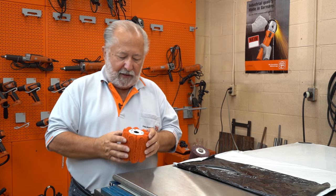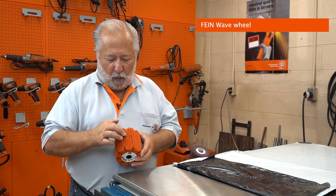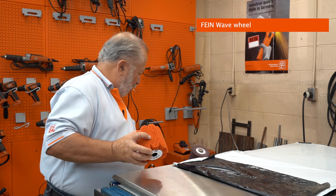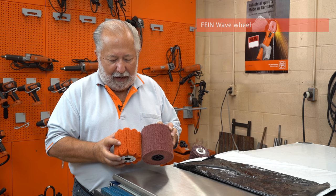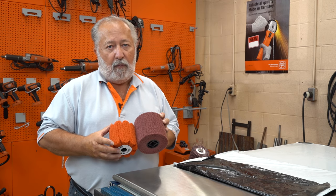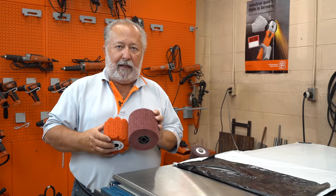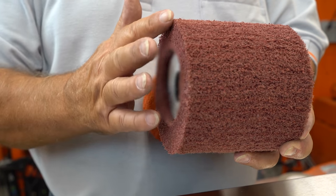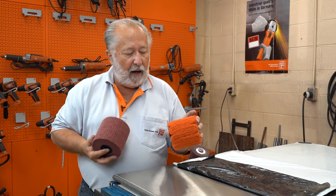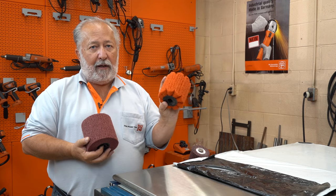After that we have a very unique wheel — this is our Fine wave wheel, or sinus type wheel. It has a sinusoidal wave curve and you can see the effect here. It's double-folded, unlike a regular fleece wheel which has a single line of fleece, so it's more durable and will last longer. The biggest thing people love about this wheel is that because of the wave design, you do not get any parting lines. Whereas a regular wheel with a sharp edge can leave parting lines on the sheet, the wave sinus wheel's scallop shape prevents that entirely.